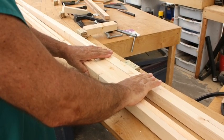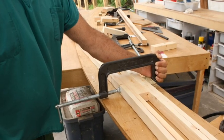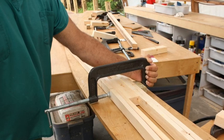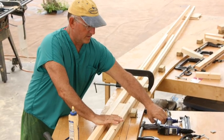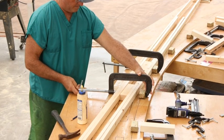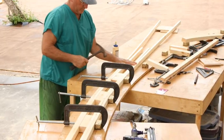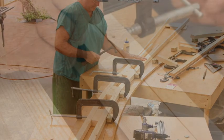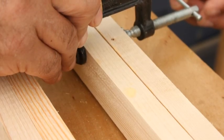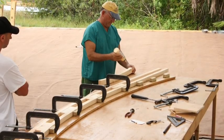I overlap the 1-by-2s so that they're 10 foot long, giving a 5-foot stagger. I clamp in the center first and after that block goes in I start slowly clamping them around the jig from the center to the ends. At the ends I cut some 30-inch pieces of 2-by-4 on my band saw to that same radius, to stiffen up the ends where it's going to attach to the bottom plate and also to the top ridge.